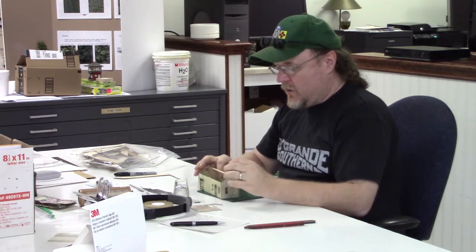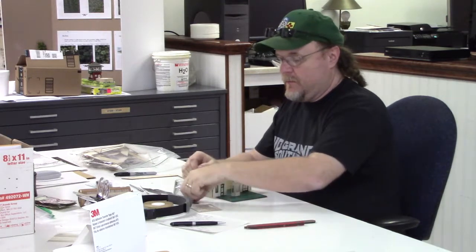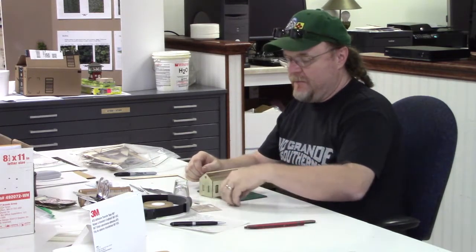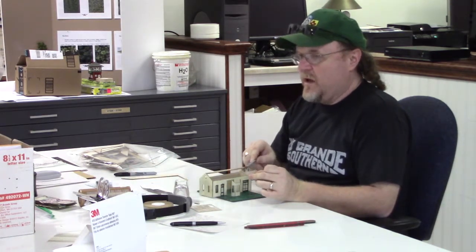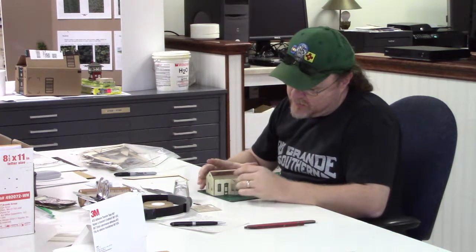Okay. So what I ended up doing is taking my desk back out. But then you're going to have to cut it this way, right? Where it turns into that little short piece, just cut straight across. If you look at the piece right there, you've got the angle and then it turns back and makes a 90 degree back there in the back. If you just cut that 90 degree section off, so if you put a straight edge across it and cut this little extra wing off, it'll fit. Once this thing goes together, it'll give you something that looks like that.